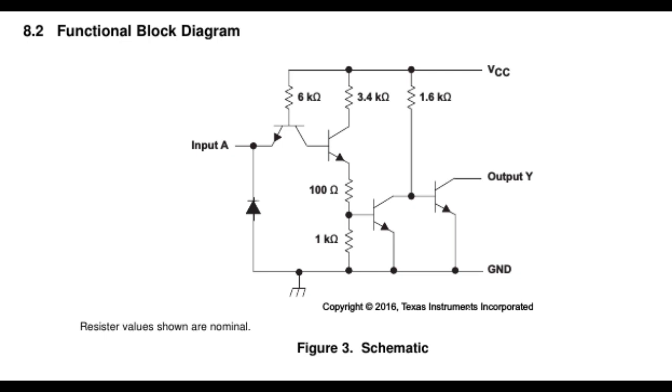That means when the transistor is turned off, it happens that this collector is floating. There is no connection anywhere until we go over the breakdown voltage of this transistor, which for a 7407 is 30 volt. So what happens is that when the input is high, the collector of the last transistor is floating, so we can have almost 11 and a half, 11.6 volts that we have seen on the 1541 board.